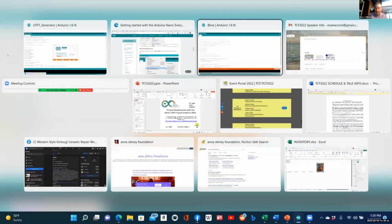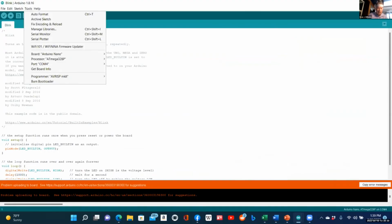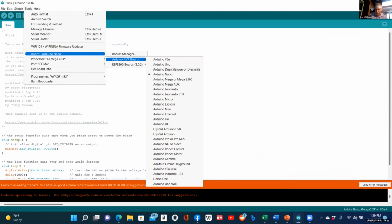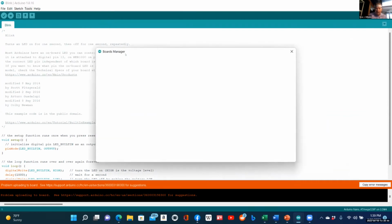So I go back to my Blink program. I go Tools, Board. I go Arduino AVR boards. And the Arduino Nano Every's not there. So what do we do? Now we go to Boards Manager.